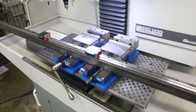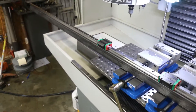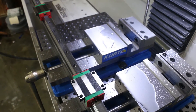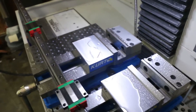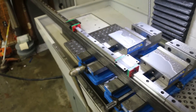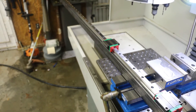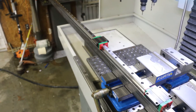I've now got all the drilling and tapping done on the complete length of the rail — I've got both of them done. I really like doing it this way; it does allow you to get it perfectly in the center of the tube once you've got your Y-coordinates set, just when you clamp it back down in the vise. Over that distance, even re-zeroing with each positioning and just kind of eyeing it off the drill bit, it worked out well.